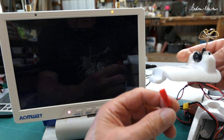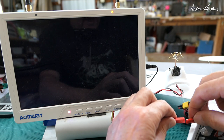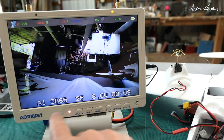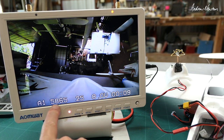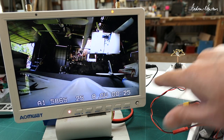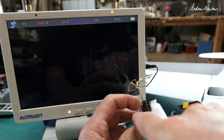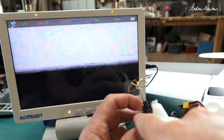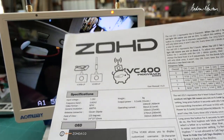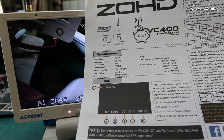Now let's connect up the little VC400 all-in-one video camera and video transmitter using the provided JST plug. We've got an on-screen display showing band and channel — A1 — and that's the frequency. This is the power and the VBAT voltage powering the camera, plus the flight time. Pushing the little button: a short push changes the channel and back to A1 again. It's exactly the same as the ZOD, so you can get the manual from the ZOD website to work out how to set it up. Video format is NTSC.